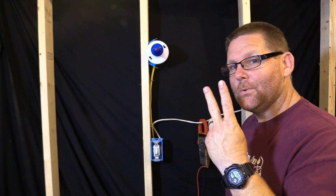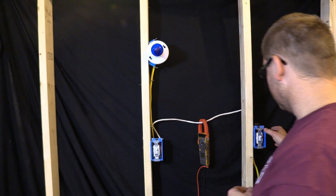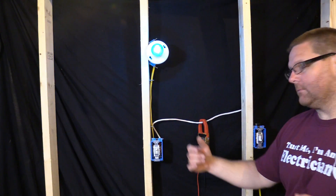And now guys, the moment of truth — on three, two, one. All right, so far so good! Bam! And you can check the other switch again — down, up, down, up, down, up. And just like that guys, we fixed the problem. What was the problem? On this switch particularly, I purposely took the hot and put it on a traveler side, so obviously it would only work when that traveler was switched to that one side. Pretty easy guys. If you have a specific idea or question, let me know in the comments below. If you like what you see, like and subscribe. God bless and we'll see you on the next one — have a great day!